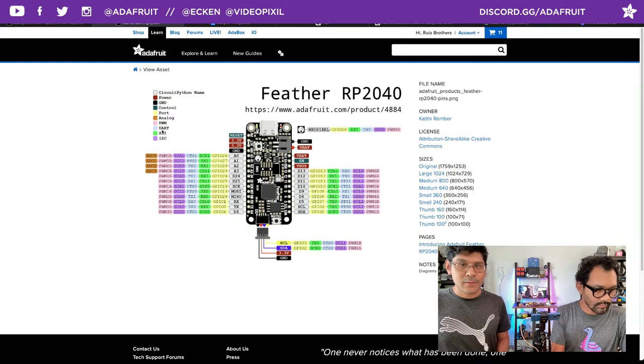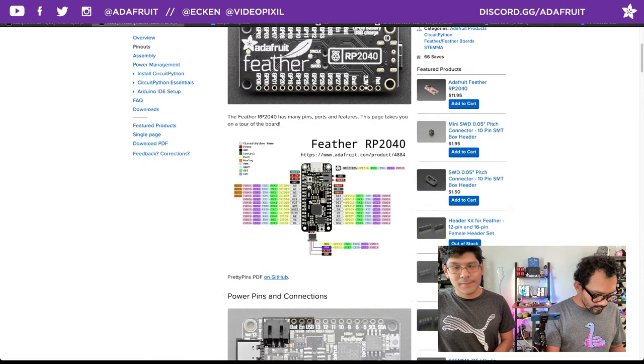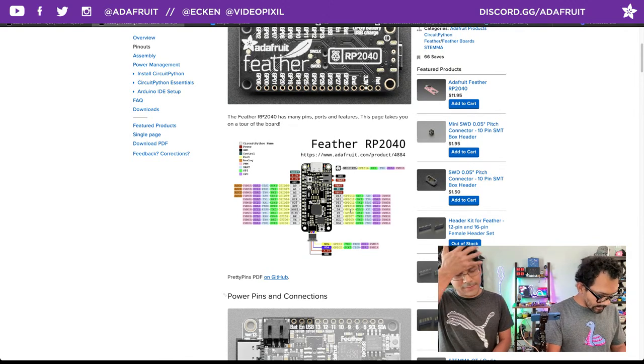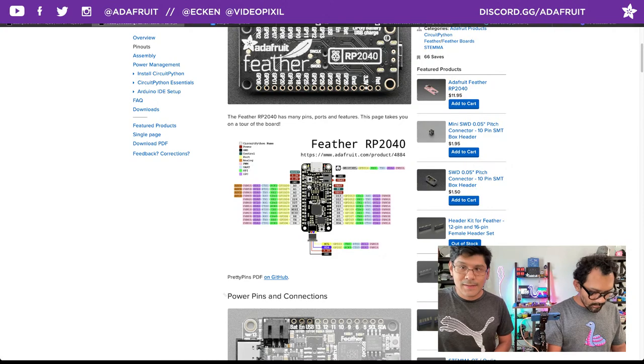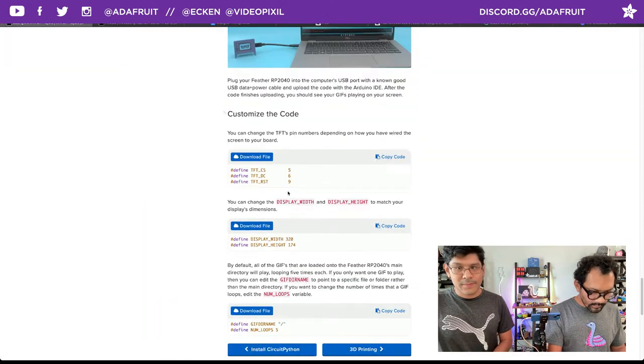Very specific to Arduino. You see where it says port here? This is kind of like a label. Just imagine port being Arduino. So the yellow is Arduino and the gray one is CircuitPython. It even says CircuitPython up there. The reason we didn't call it Arduino port is because of the Pico SDK. Thank you, Pico SDK. That took us a little bit of time to figure out, so you'll want to update these pins accordingly.